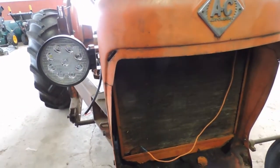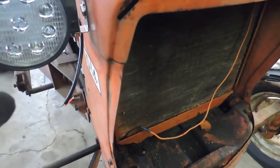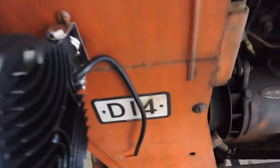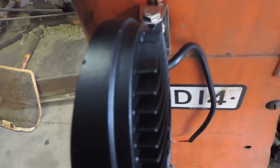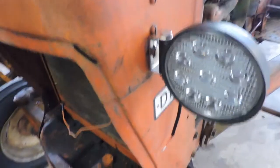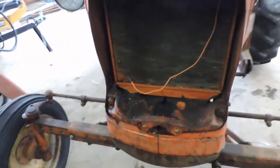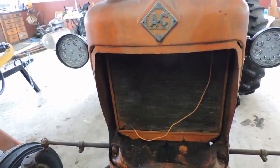The original equipment lights didn't have a bolt going through the sheet metal — it was actually a hollow threaded pipe where the wire fished through the middle. I don't have a second hole on the outside to get the wire in, and the mounting brackets that came with these new lights use bolts, so I'm going to have to drill another hole in the sheet metal on each side. As I said, I'm not trying to make this tractor original, just functional.